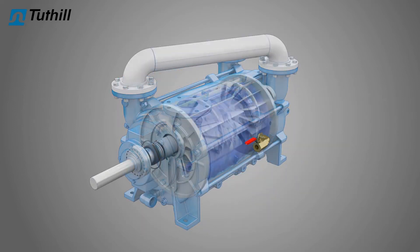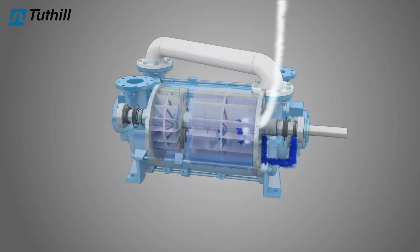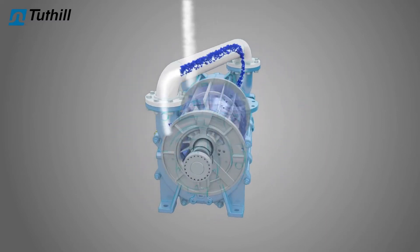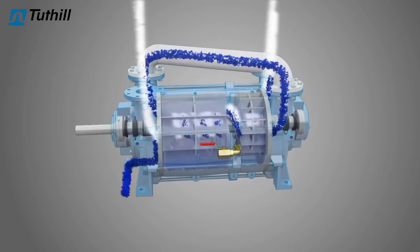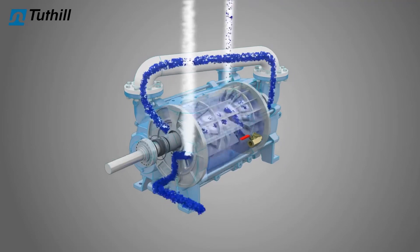The KLRC is a non-pulsating vacuum pump designed to remove gases through the use of its rotating impeller blades that enter and leave a ring of liquid. The impeller forces this sealing liquid to the periphery of the pump casing, where it forms a ring of liquid around a center void. The impeller shaft is mounted above the center line of the casing.